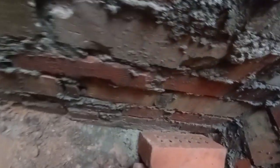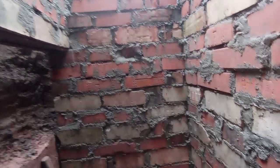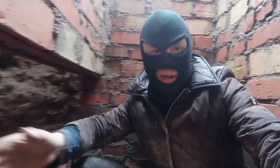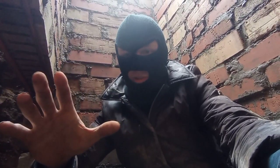What I mean by that is if you look at this — I need to crawl inside the tunnel hole — if you look at that part of the wall, notice how it's completely full and there isn't any gaps. But if you look over here, this whole section of the wall is supported by this single pillar of bricks, and there is quite a lot of weight on this one single pillar. My worry is that if enough force is applied to this pillar, it might buckle outwards, and a good portion of this tunnel might actually collapse, or the whole thing might collapse completely.